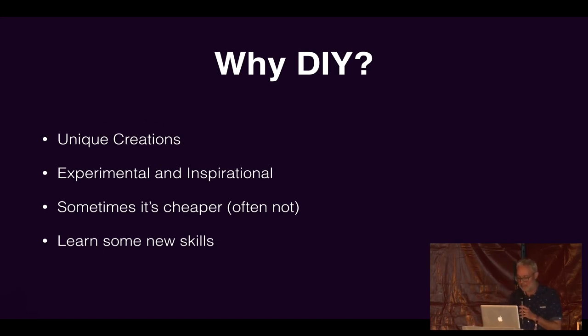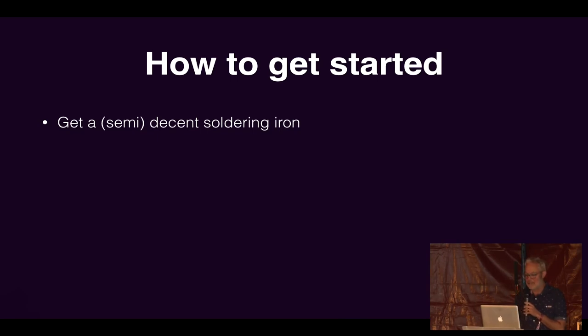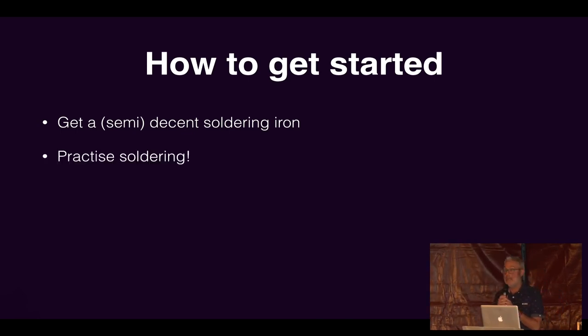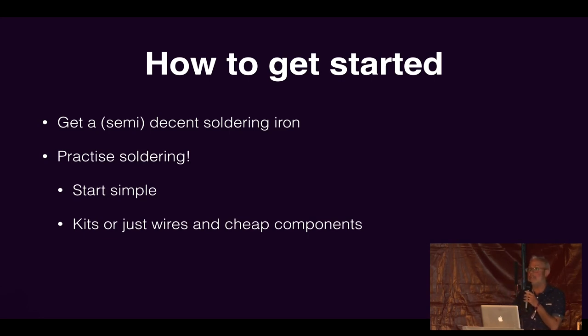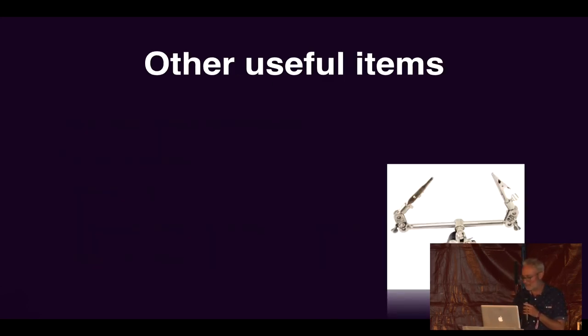So how do we get started? The first thing is get yourself a half-decent soldering iron. You don't need to spend a huge amount of money, but I'd advise not getting those super cheap ones with just a plug on the end. Something where you can temperature-control it should be absolutely fine. Practice your soldering — you're going to get problems in all sorts of areas, so if you can make your soldering good enough that it isn't the problem, that will make debugging simpler. Start simple, just get some kits and wire. There are loads of YouTube videos, so just give it a go. It feels daunting at first, but you can get it.